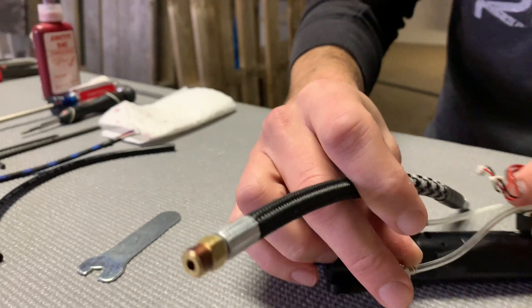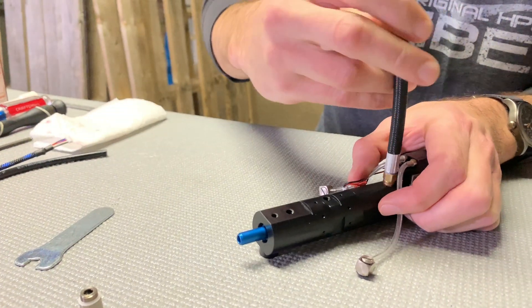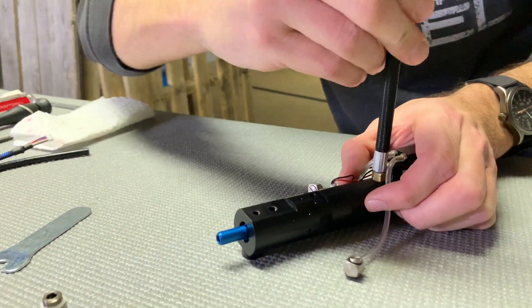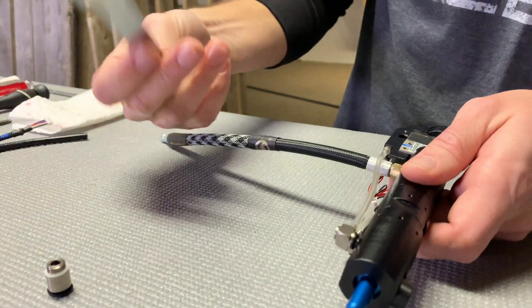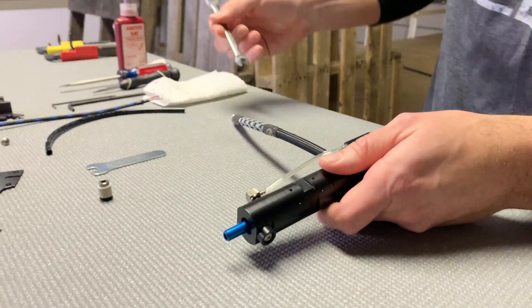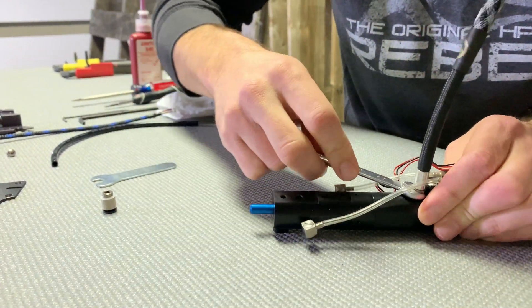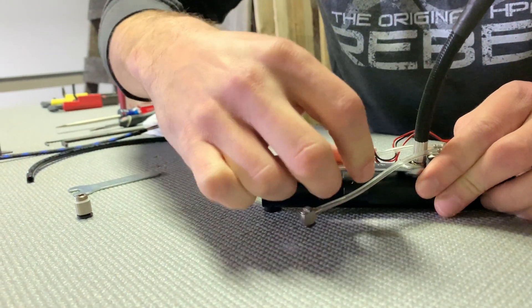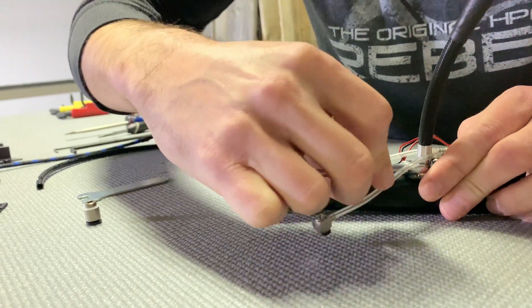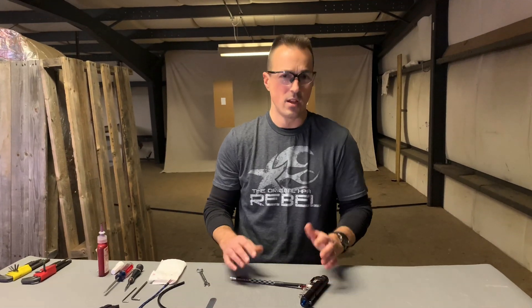You can just start it by hand. They usually come with a small cheapy wrench, but it's really hard to use. If you want to use a regular wrench, use a 5/16th. Just snug it down — you don't need to be super tight, but nice and snug is what we're going for. After that, give it a couple hours for the sealant to cure, and that's about it.